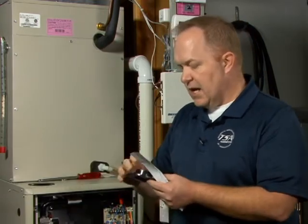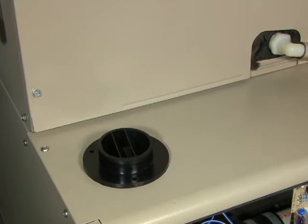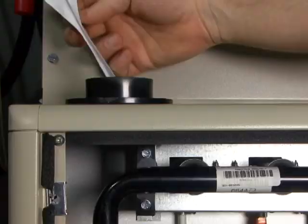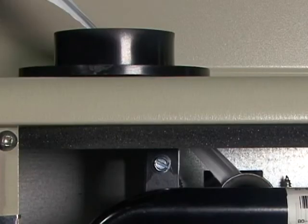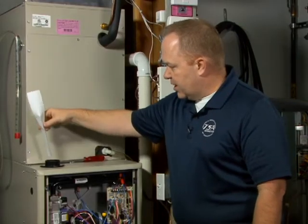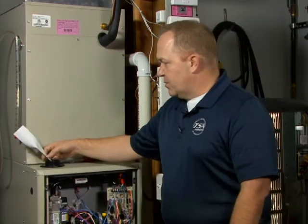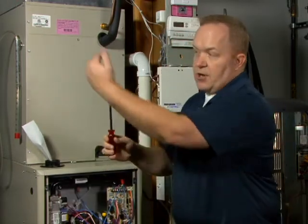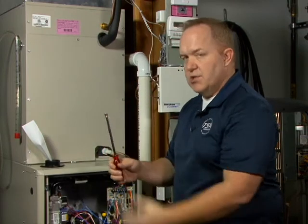In the event that you get the intake air installed incorrectly, the intake air will come down and travel through the louvers — and as you can see here, the demonstrator is resting right on the last burner of the manifold. Your intake air will come down, pass through the louvers, and basically drop that intake air right against that last burner. That last burner is the home of the flame sensor. So ultimately your flame sensor will be sitting there with that intake air coming in, pushing your fuel off away from the flame sensor, and then it's going to struggle to prove flame.